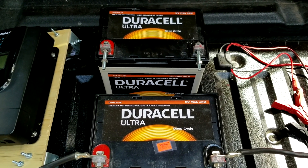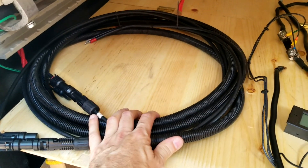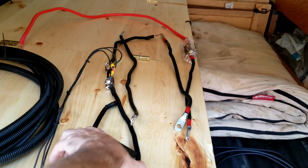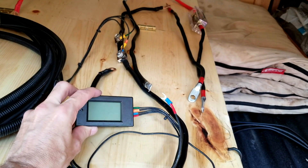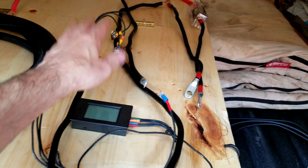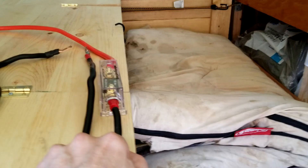They can run appliances all night — I tested them inside. As far as cables go, there are the solar panel cables. The solar panel isn't shown because it's one of the last things I install — it's stored in the truck. There are the negative battery cables, a shunt resistor for the multi-ammeter, which shows battery volts, system volts, amperage, watts, and watt-hours. And then there's the positive cable with a fuse, which is essentially fusing the inverter.